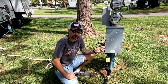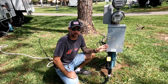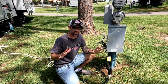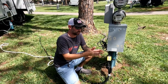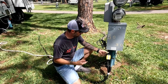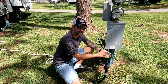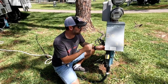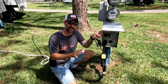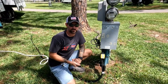Do check your power pedestal before you unhitch from your RV and get all set up, because a lot of times these power pedestals are either fried, don't work, or have some kind of an error. The last thing you want is to get everything set up and then find out your power pedestal doesn't work. What we do is as we're coming through, I'll get out of the truck, plug in our surge protector, and it gives me green light indicators showing there are no errors. I'll also visually check to make sure nothing looks fried or sketchy — if it does, I'll go back to the office and ask for another spot.